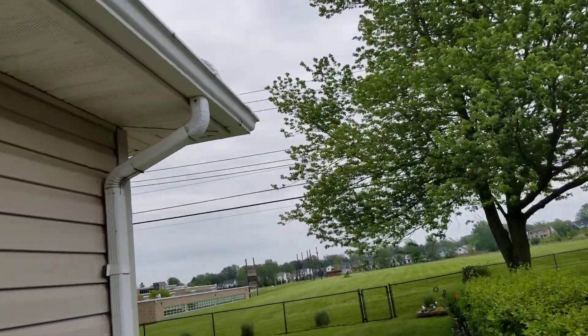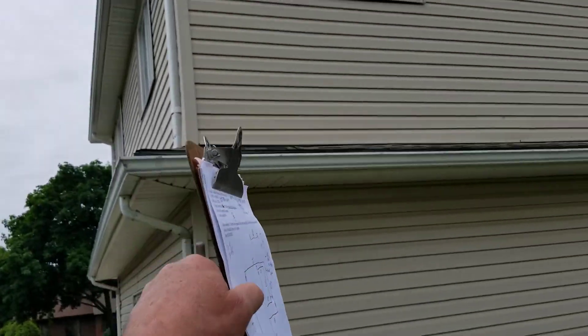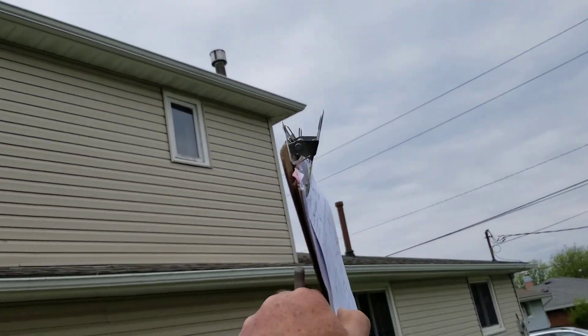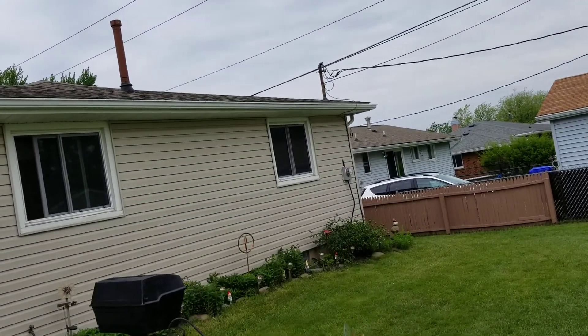On the back, we're going to take this outside corner and bring it up all the way and let it go towards the front. In the middle of this rear section we'll crown that up high, and that should get to that corner with no problem. Then we'll take an upper downspout from the upper hip roof and deliver it into the lower gutter, letting everything go to that side with three by four spouts.